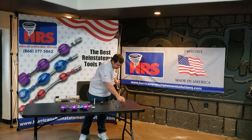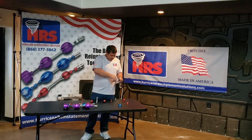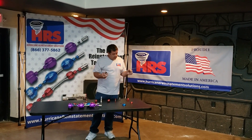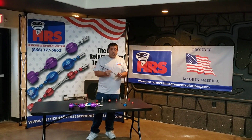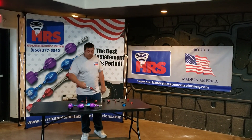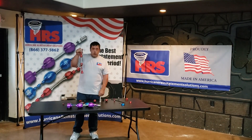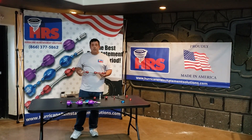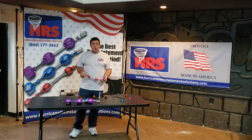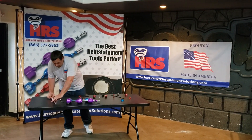Now let's get back to taking it apart. The head has two Allen screws in it — pull the head off with the two Allen screws and it comes off. If you notice, there's a locking ring, and that locking ring is there for a reason. If your guys are tightening up the tool and they lose the head — the head fell off — the rest of the tool will still be pulled out. You do not have to fish all of this out of the line. That is very important. With some other tools on the market, when we lost the head, we were fishing out 20 parts — it was a total pain.